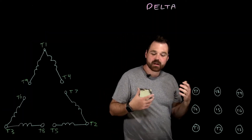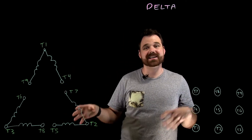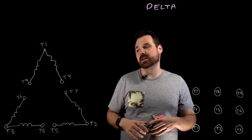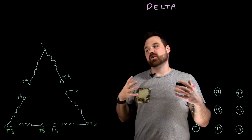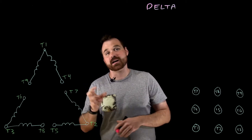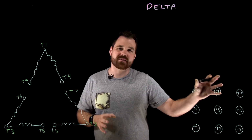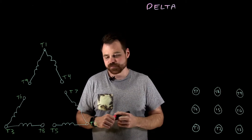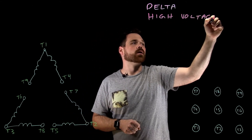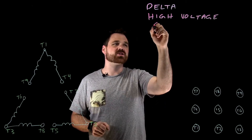Hello, welcome. In this video, we are talking about dual voltage motors — this one in particular is about a dual voltage Delta connected three phase motor. We can check out the terminal identification in another video. We buy this Delta motor, it's rated for dual voltage — quite often it's going to be like 230/460, meant to hook up to a nominal voltage of 240 or 480. We have nine terminals all sticking out of our junction box, and we're going to talk about how to wire this for a high voltage connection — connecting this motor up to a 480 volt source, which we usually call a series connection.